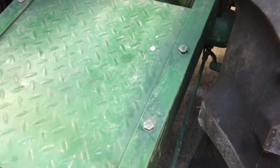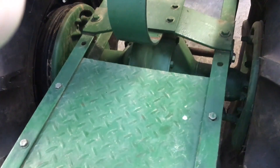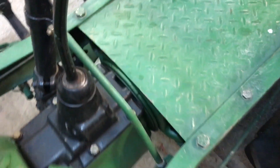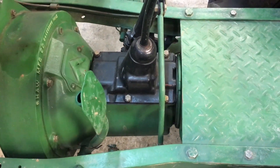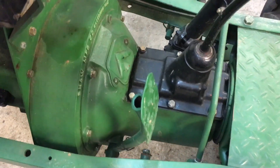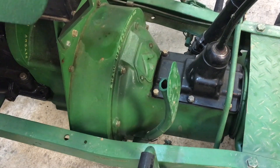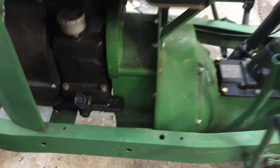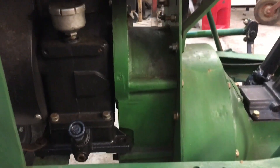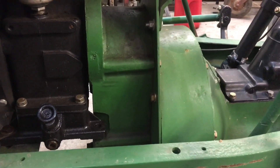You can see what they've done - they've just hooked a brake lever on each side, so you've got steering brakes. I think Ford went to hydraulic brakes in the late 30s, so this would date it maybe to mid-30s. Some of you Ford experts would know. And I'm assuming this is a little Ford three-speed car transmission. I pulled the inspection cover and it's got a regular car-type clutch in it, looks to be about a nine-inch or so. Definitely heavier than you would need for this apparatus.